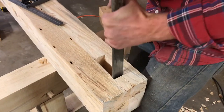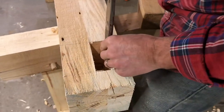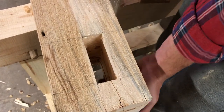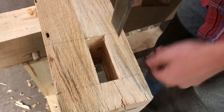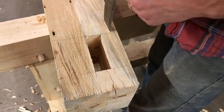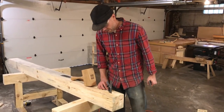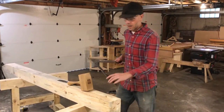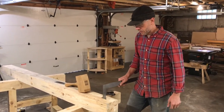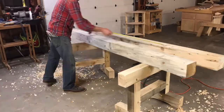As we're cleaning up a mortise like this, you have to be really careful not to send your chisel all the way through, or you risk blowing out wood on the other side. Go down about halfway, flip the board over, and readjust. Our mortise is relatively square and our framing square slides through just like a tenon should. We're going to move on and cut this three more times.